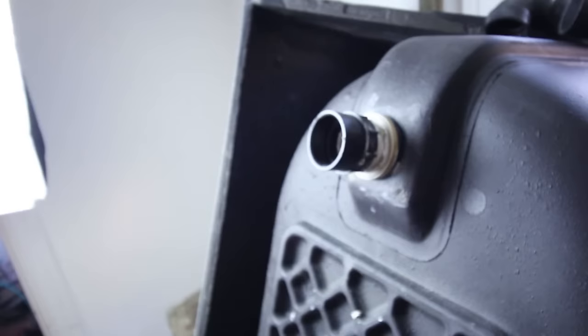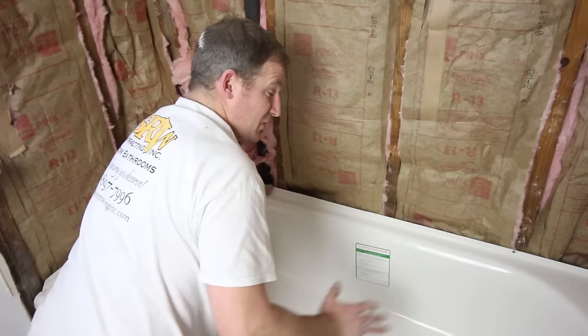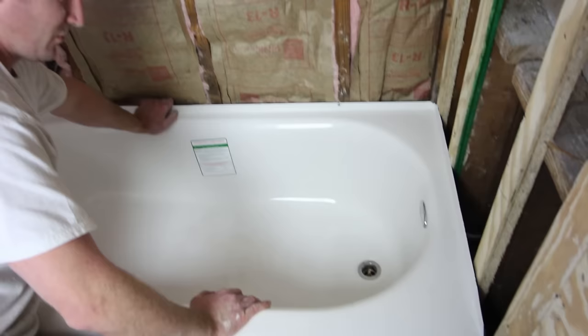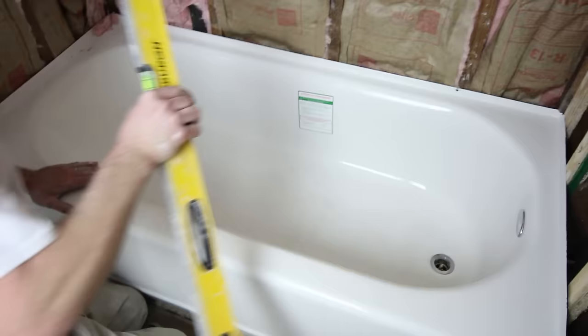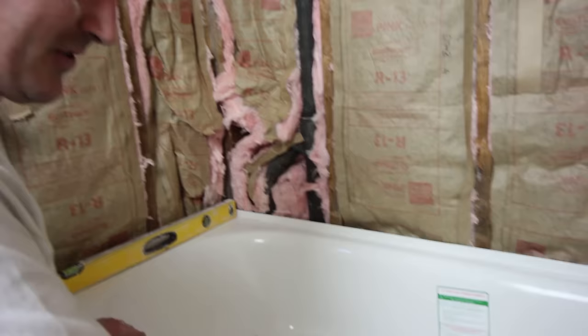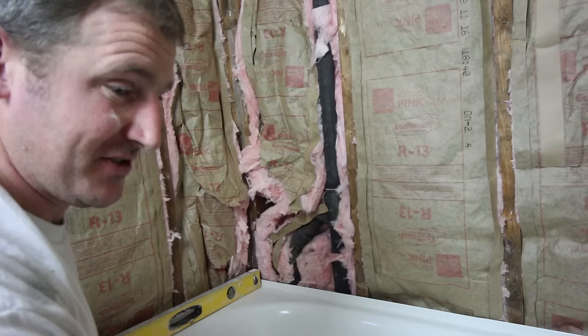Now that we've got it converted to ABS, we're basically going to bring this straight out this way. We dry-fitted our tub — after the drain piece is in, you want to dry-fit the tub before mortaring it down. This tub is actually just sitting nice and level because I have that floor leveler I put in the day before, which makes it so much easier. The base on this tub is designed to be able to sit on a level floor, so you can opt out of using mortar underneath it.